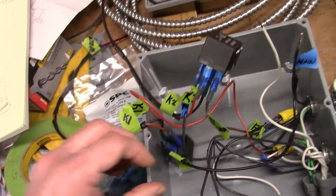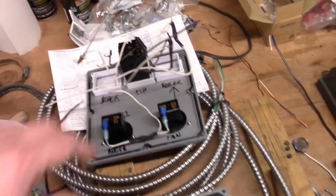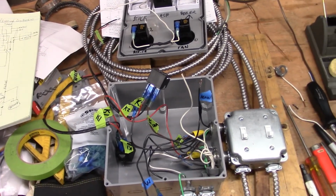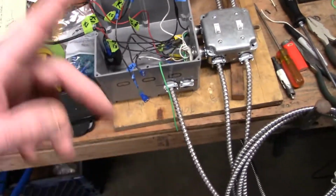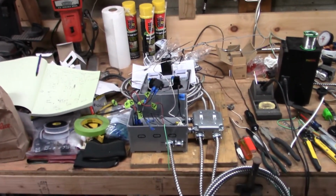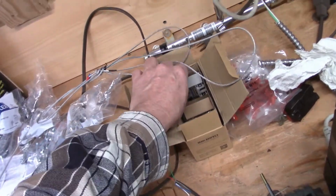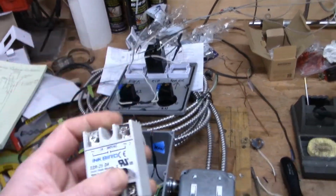But as we said before, I have this one controller which only reads centigrade, and the other three are out on the boiler right now. So we're going to swap that over to the analog controls temporarily, so we can put the digital controllers in here and test this whole mess. We'll probably hook a couple motors up to it and see if these relays blow up or not. If they do, the fallback plan is to temporarily wire in a couple of these solid state relays.